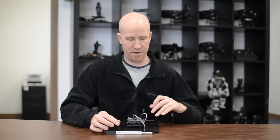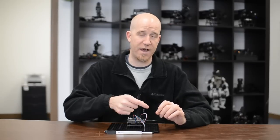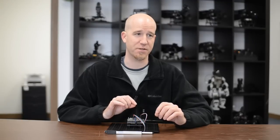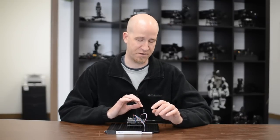What's happening in the code is there is a dead band in the center of the joystick, and it's looking to see if the joystick has moved out of that dead band. The reason we have a dead band is that not every potentiometer center is in exactly the same place, so you have to give it a little wiggle room so that there isn't drift when you're sitting stationary in the center.